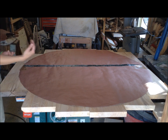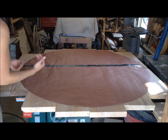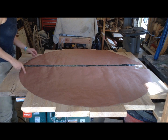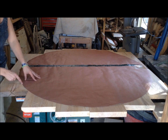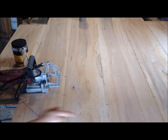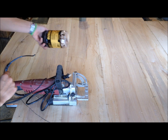The reason I'm doing this is because I don't have a lot of long clamps and since this is over 50 inches, I'm going to end up pulling it together in two sections of three and then one big section all together. So in order to make sure — since my clearance is pretty small in certain spots — I put my biscuits in the right spots and glue this up so my pattern will match. I'm just going to trace it. With my pattern traced, I went through and marked about six inches apart for the biscuits. Now I'm going to make the holes for the biscuits using a biscuit joiner and number 20 biscuits.